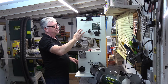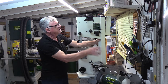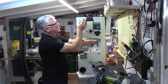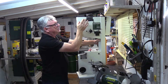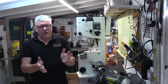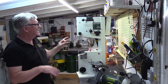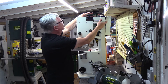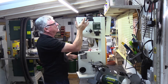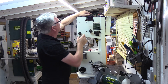One of the added features on this machine — it's quite a nice machine — is a quick release for your bandsaw blade. That's a nice little feature, especially if you're doing like-for-like changes. So if you're changing a 3/8 blade for a 3/8 blade, you're going to nearly be there on the setting. If when you bring it over it's too tight, ease it back a little bit and take a little bit of tension off. If it's too loose, bring it back and put some tension on.